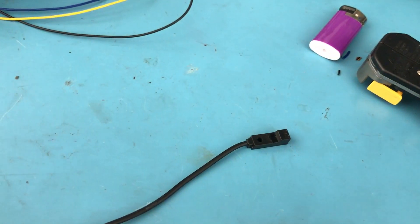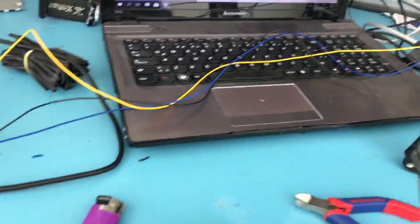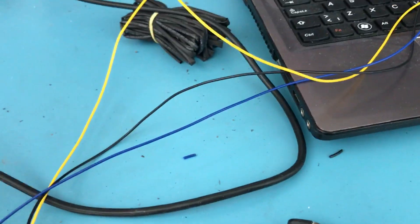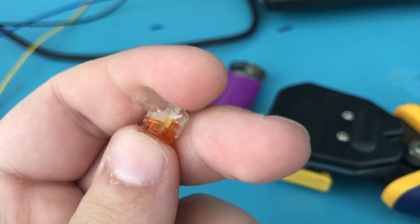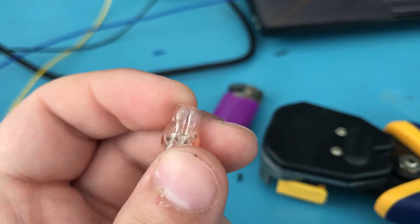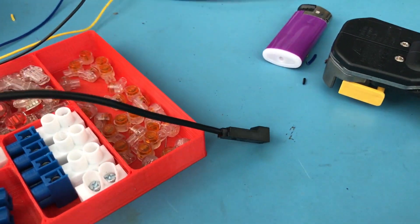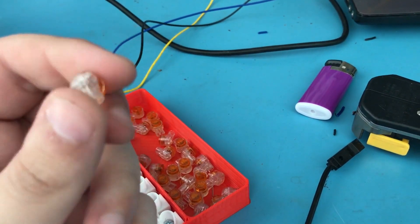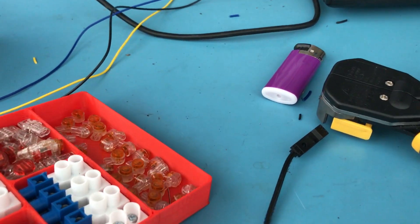All that's left is mounting it, and I made a new cable going into the control box. The problem was simply that the little terminal blocks I like to use work perfectly for normal thickness wires like 22 or 24 gauge, but whatever gauge wire the sensors use is way too thin - and because of that it can have contact issues, as I discovered. So I decided to make a new cable and properly solder them.